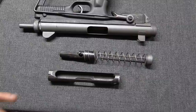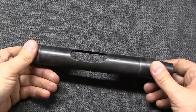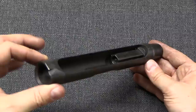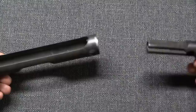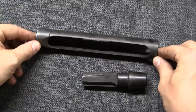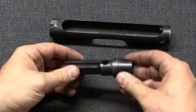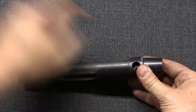To me this is the most interesting mechanical element of the Commando — the fact that the bolt is in two pieces. When the gun is firing it's in a configuration very much like other telescoping submachine gun bolts, especially the Czech guns, the Czech Model 23, 24, 25, 26. However, that would be a relatively complicated part to manufacture. If you separate it into two pieces, you're left with two parts that are both very easy to manufacture. The vast majority of each can be done on a lathe — turn the inside, turn the outside, drill a hole, mill that out, cut the sear notch. You put it together and it works exactly like a telescoping bolt, with your charging handle holding the two pieces together. Much easier to manufacture — that's really cool.